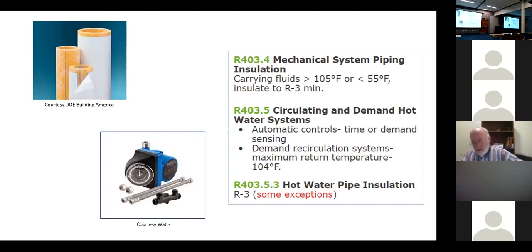And what happens? The coil bursts, and what's it hooked to? Full house pressure. And you got water everywhere. And you put in a 6-story building, the one I'm thinking about in particular, and it just pours gallons of water, hundreds of gallons of water if someone's not there to shut it off.